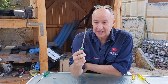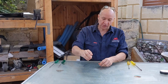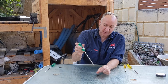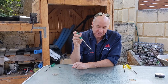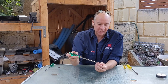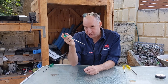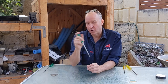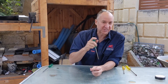It's not magic, it's science. You can imagine how useful this is when you're working on your car and you've unscrewed something deep in a door skin or something like that — the screw is sitting down where you can't reach it, but you can just dip the screwdriver in there and pick it up. Some of these screwdrivers I did that 15-second trick on about two years ago, and as far as I can tell they're as strong now as the day I did them. But even if it wore off after two or three years, as you saw, it takes about 15 seconds to remagnetise them — so just do it again.